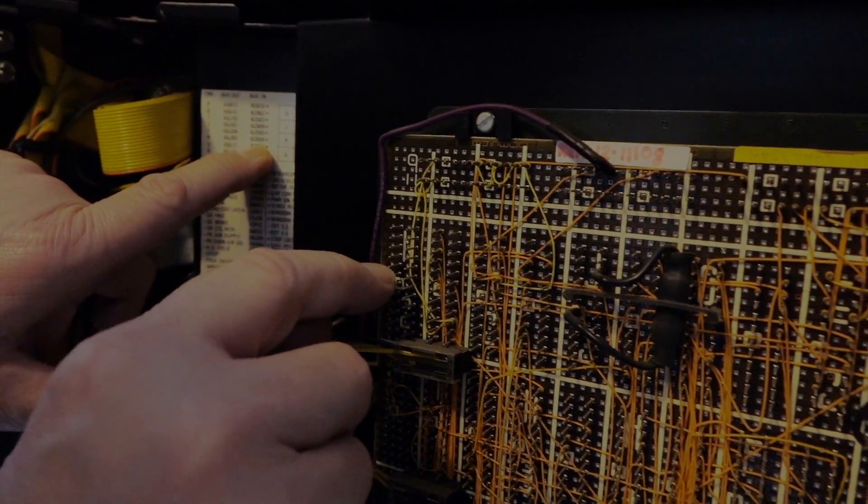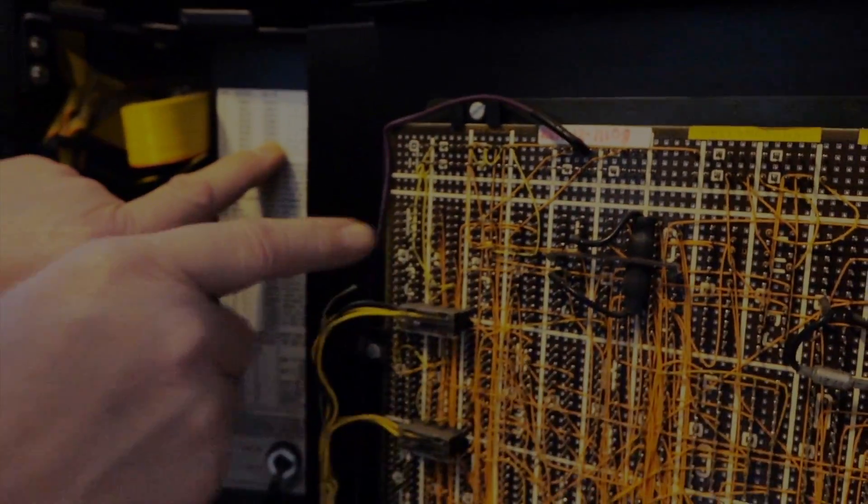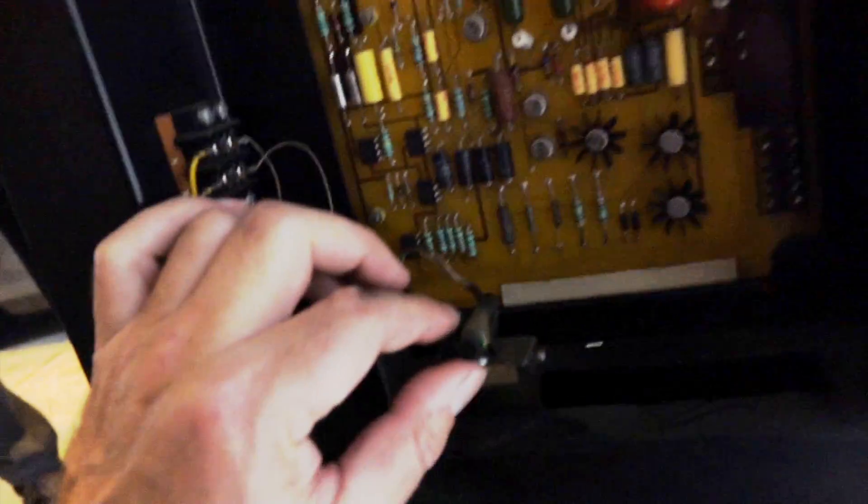There are all the test points here. You would say N2, which is N2 here — B06, so B. How do you know it's N2? You can see the lettering — I see A2, C2, E2. So it's A through N, and then 1 through 8, but the edges are all connectors only. We found this little interesting bit — there's a little mercury switch here, which apparently is sensing the airflow. The machine won't turn on if the airflow is not going.